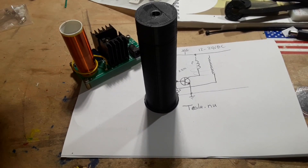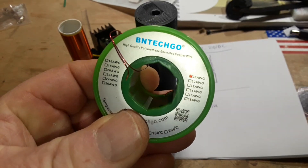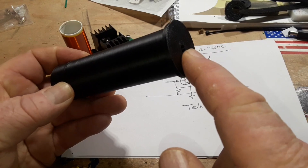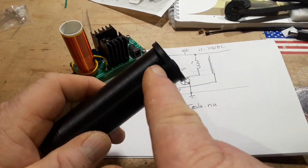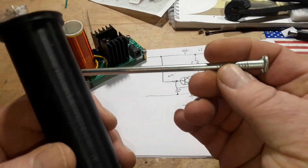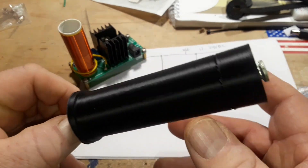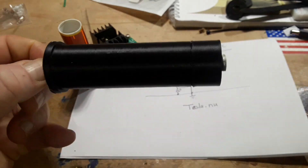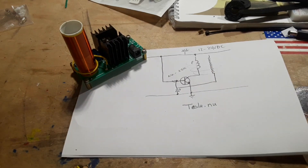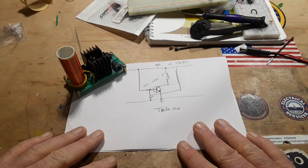You're going to wind your coil with enameled magnet wire. I'm using cheap stuff from Amazon — this is 28 gauge. Pass your wire through the inside hole, leaving about four to six inches hanging out. Then use this aluminum gutter nail, which fits through the bobbin — clamp that into your drill at slow speed and you can rotate it to get a nice even wrap. You've now got just about everything you need to design your own Tesla coil.